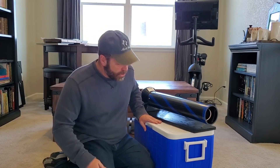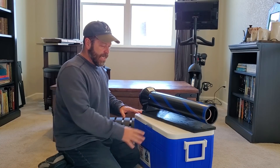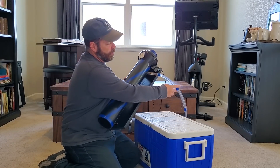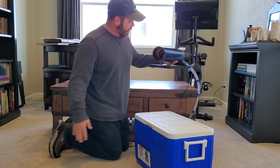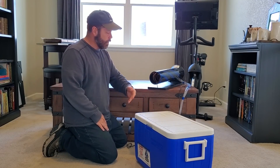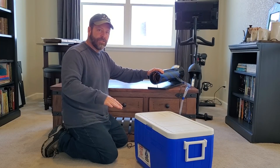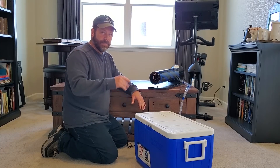The last advantage is the versatility. Normally these things are built inside a cooler, but with this design the cooler only holds your ice and water. You pump your ice-cold water up through the coils through this tubing, so your actual fan can be placed anywhere you want. The water pump in here will pump up to five feet — I'll put a link in the description with the water pump and all the parts, plus a full supply list.